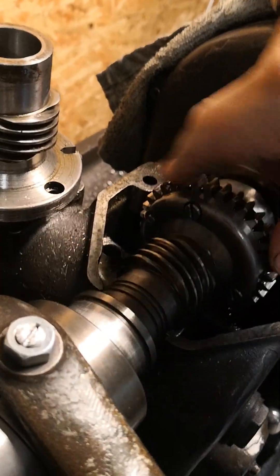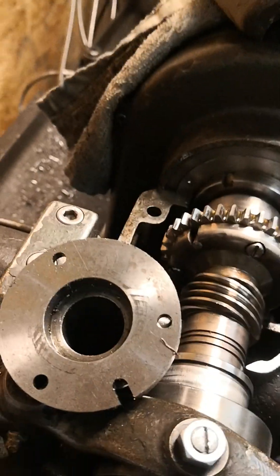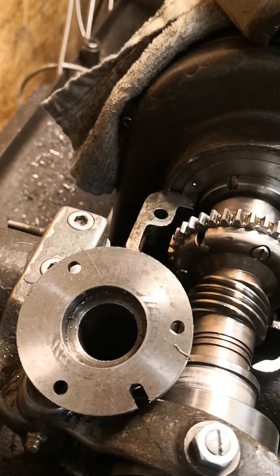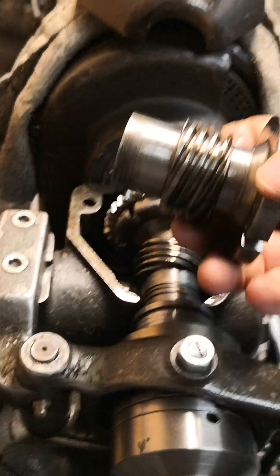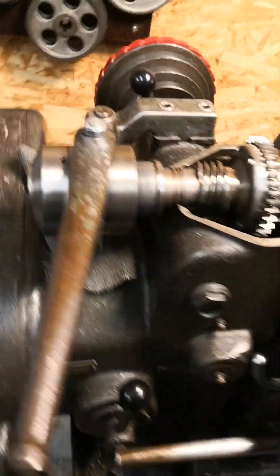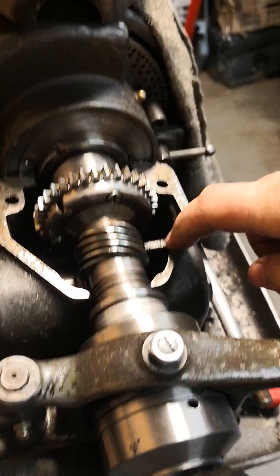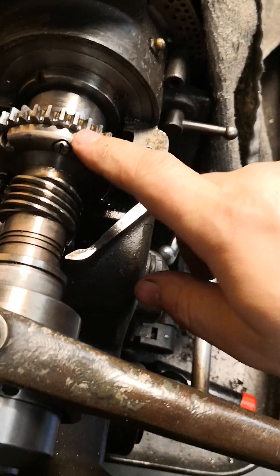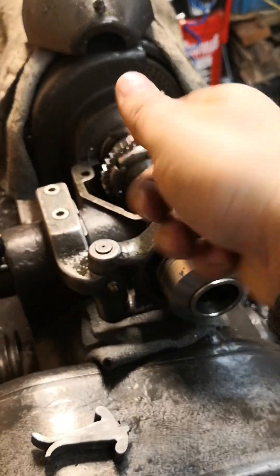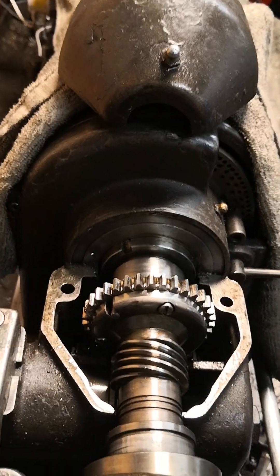You see here is a notch — normally this is also original. This is not original; I modified this after I saw the slot. I made this piece with a slot too. Normally here is a hole — I made a slot in it. It makes the whole reassembly very easy, so never sell this off, just keep it in your drawer. To mount this piece, you have to unscrew three screws — don't lose them. When they fall in, you can fish them out of the oil. I use a magnet: just put the magnet beside and apply pressure on your screwdriver, push and turn the screw out, then take the screw while it's still on the driver — then you don't lose it to the oil bath.